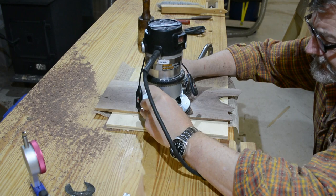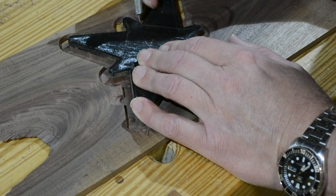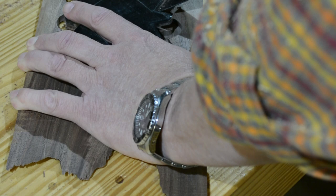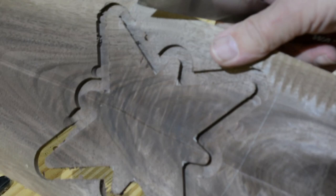I'm going around a second time just for good measure to be sure that I've got a clean, crisp edge. What I'm doing now is marking the corners where the router could not get to, because a round bit can't cut into sharp corners. Once they're marked and I know what I need to do with hand tools, I can take off the tape and head to the bandsaw to get the piece broken out of the parent wood.